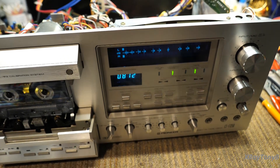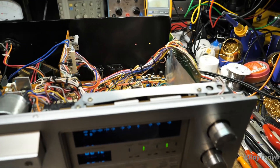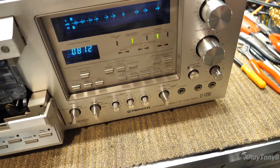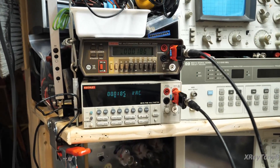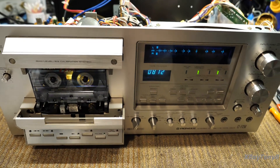Now we're going to do the record and playback frequency response adjustment. To do that, we're going to feed a 333 hertz signal at 31.6 millivolts into the record input. I did verify with the meter that that is in fact what's going into the record jacks. These are tiny signals. The two potentiometers are not perfectly tracking when you're dealing with one millivolt increments, so you have to fiddle with each one individually — there's a lot of friction between them. This is about as close as I could get; it'll bounce around one millivolt or so, and they want you to have 18.8 millivolts roughly. We're splitting hairs here.